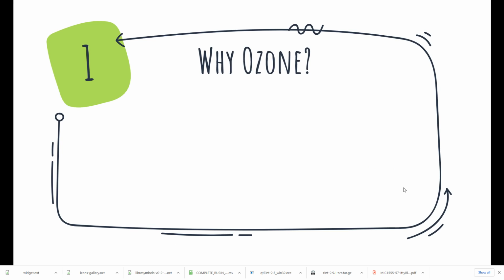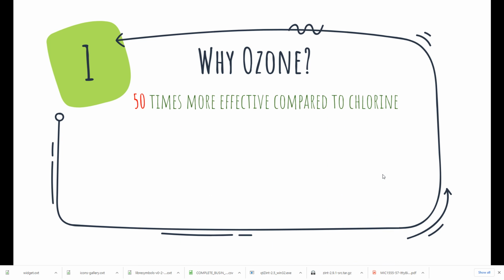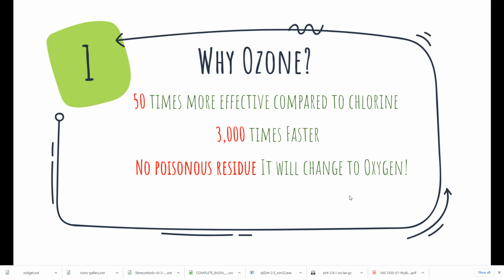The first question is why we use ozone. Ozone is 50 times more effective compared to chlorine, and it's 3,000 times faster. And the most important thing is it has no poison residue. It will turn to oxygen. That's why ozone can be used to kill virus on everything, like food. Ozone has been used a lot in water purification, but seldom in air because it's not so easy to do it safely. Here I want to show you how to do it safely.